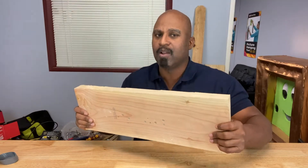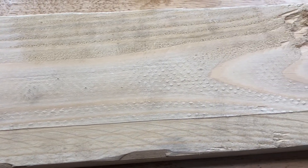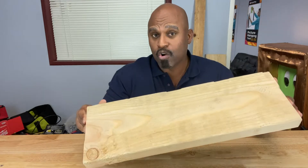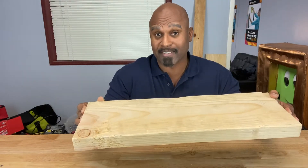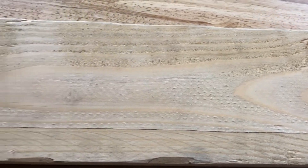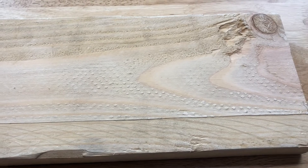These small percentages may not seem like a lot, but when it comes to precision in building or construction, they sure matter a lot. When the math is off, everything's off. To avoid your wood project ending up misshapen or falling apart because of moisture, you want your wood to reach what's called its EMC — equilibrium moisture content. That's the point where the wood is no longer absorbing or releasing moisture, and it's in balance with its surroundings. One way to do that is to store your lumber in a cool, dry area, about four inches off the ground and covered with a tarp. But if you arrive on a construction site and don't know if the wood has reached its EMC, you might want to pull out your moisture meter.